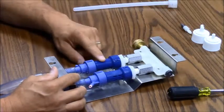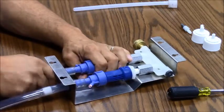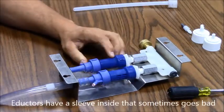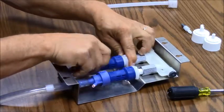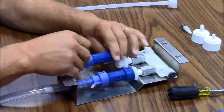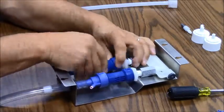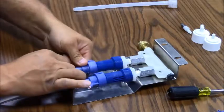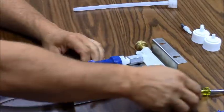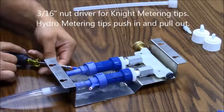This particular eductor has a broken area where the metering tip fits in, so we're going to replace it here. If there's a sleeve inside the eductor that goes bad and it doesn't draw product, this is another reason the component would need to be replaced. Simply unscrew it after you remove the hose, put the new one in place, and screw it back in. There's a hose washer in there so it should prevent leaking. Once it's in the right spot, use a 3/16-inch nut driver to put the metering tip in and screw it right in place.